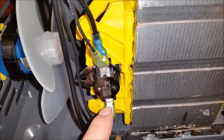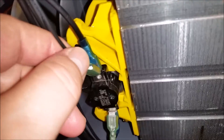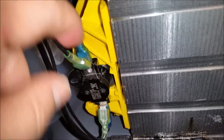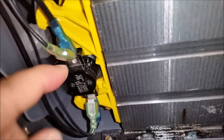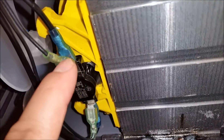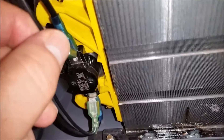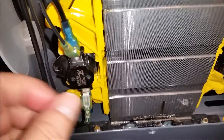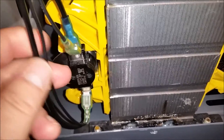I've got this switch in now. Initially we were going to make these 10-gauge too and we still will, but I didn't have any piggyback terminals. A piggyback terminal is basically a single female terminal with a male tab that comes off and goes up, and you push this on. I didn't have those yet — I ordered them — so we're going to have to do that later.